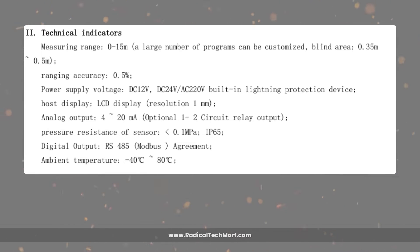Now let's see some product parameter specifications. First, this ultrasonic transmitter offers accuracy of plus or minus 0.5% of full span. It has various range options available like 0 to 5 meters, 0 to 10 meters, or 0 to 15 meters, which can be selected as per user preference. It offers a wide working temperature range of minus 20 to 60 degrees Celsius.